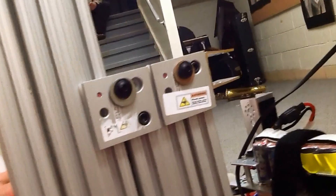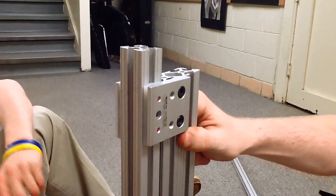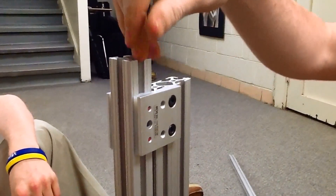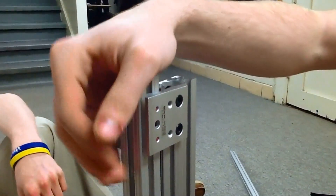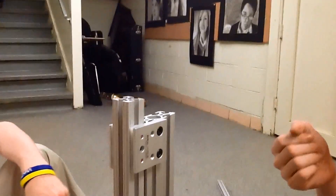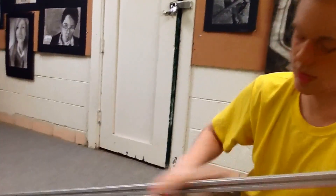To attach the carriages, you basically assemble the three parts on the one you don't want to move, and then you lock it down here and here — there's another pair of screws in here. Then you lock it down with the little screws in the middle section, and then you just slide the moving section through it. It works perfectly. As a personal example, I took a carriage, put it at the top of this entire 80-20 bar, and slid it down. It slid the entire way without stopping. It's a very solid, steady linear slide.